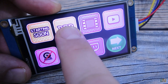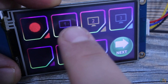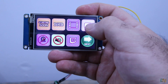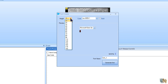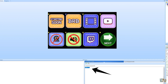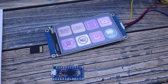As you can see we have 7 buttons on this page and if you click next you get a different design. Like this, you could add as many pages as you want. Check my Nextion editor video below and you will see how easy it is to create a TFT file for this type of display. In the Nextion platform, each button will send a different number from 0 to 13 and later we read that with the Arduino.